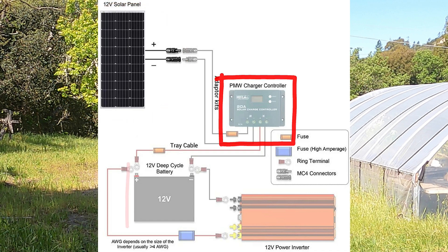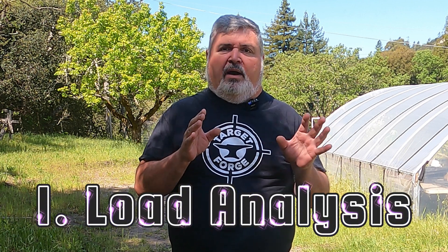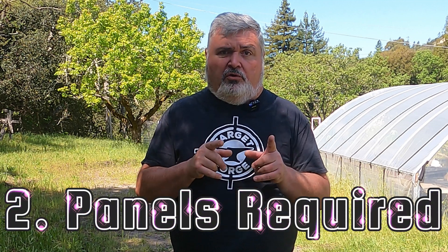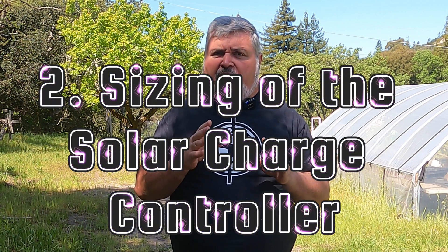What are the components of a portable solar solution? In this image we'll see solar panels, a charge controller, a battery, and an inverter. For this effort we can ditch the inverter, as everything I plan to run is on 12 volts DC. The steps for design are as follows: load analysis — what power do you actually need and how often; sizing of the solar panels proportioned to the available solar energy; sizing of the battery — how much storage capacity do you really need; and sizing of the solar charge controller — a little room for future-proofing here is okay.